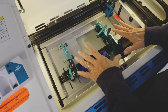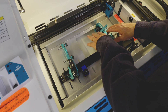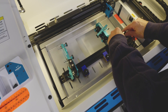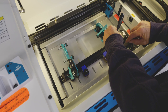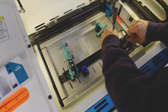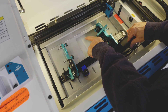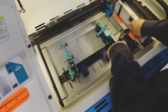One thing that is absolutely critical when using this tray: make sure you focus your tumbler before you plug in the rotary to the Bolt. If you plug it in first and then auto-focus your tumbler, depending on tumbler size there's a possibility for conflict where the tray could come up and hit the connection. Always auto-focus your tumbler before plugging in your rotary. The only time you'll have a conflict is with very small diameter tumblers, so just be careful there.